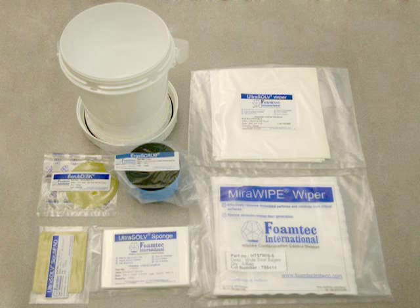In normal circumstances, our HDP dome scrub kit will efficiently scrub the dome in under an hour. Depending on the wafer count and the technician's discretion, either a 180 diamond scrub pad or a 360 diamond scrub pad can be used.